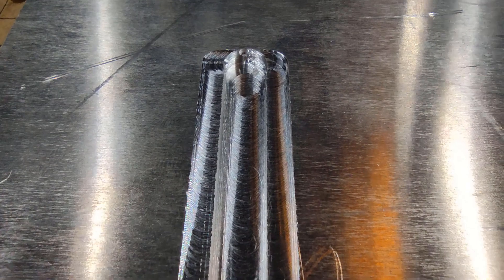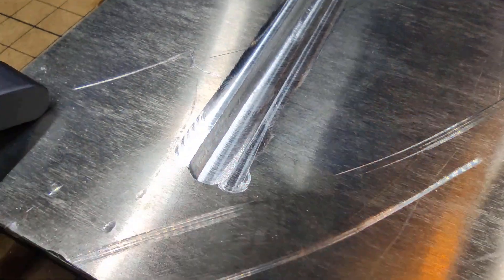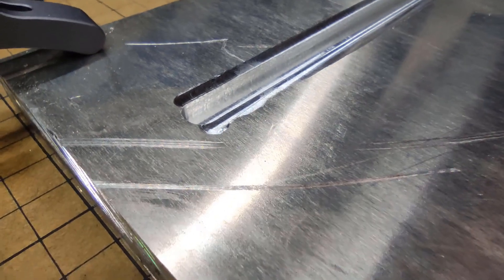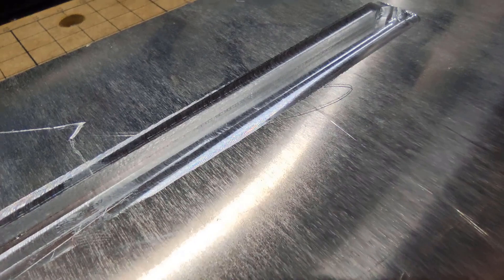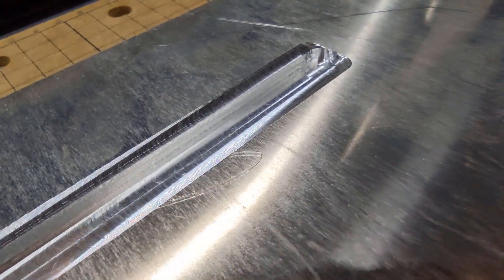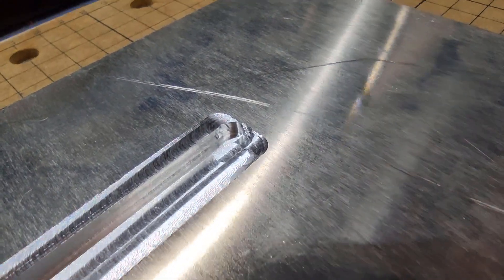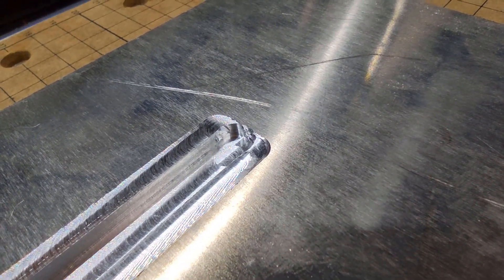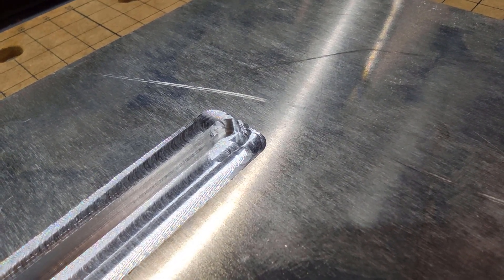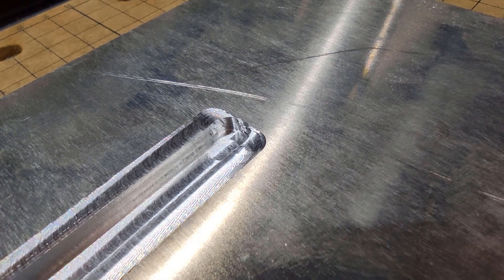Here is a detailed look at the results. The floor of the slot looks quite okay, but on the left wall you can see marks. These come from when the table moves to the back — the bit starts swinging and makes noise. Also every time the bit goes down it starts to swing, which is why the entry and starting points don't look nice.